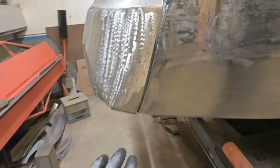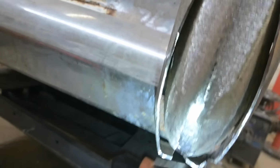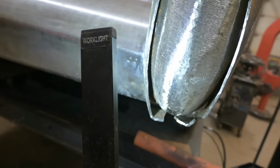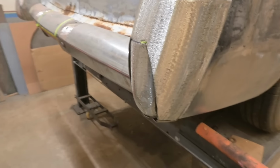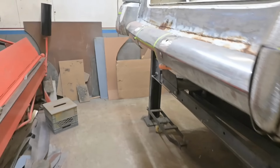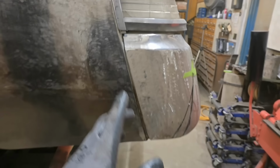See that? So now we're gonna have to pull this bumper off, and I'll show you why. Up inside, you can probably just see it. See that bracket? Up in here. That's preventing me from squeezing these sides in and mating it up with that corner piece. We've also nipped the bottom, tucked it up, radiusing this up this way. And on the driver's side, well, we have to finish cutting that out. The gap is a little bit tighter at the top than it is at the bottom.